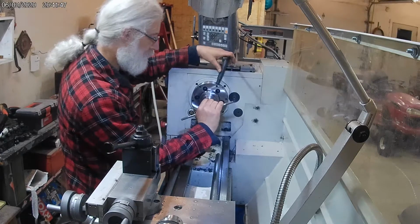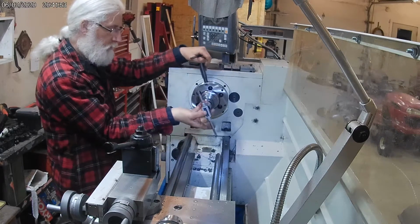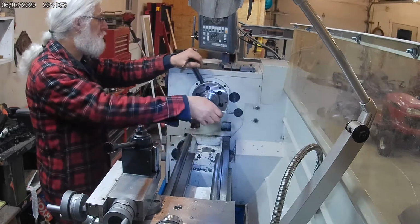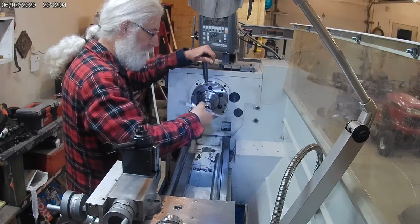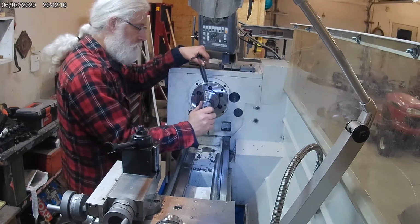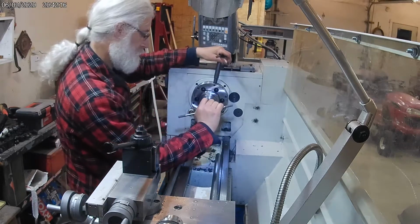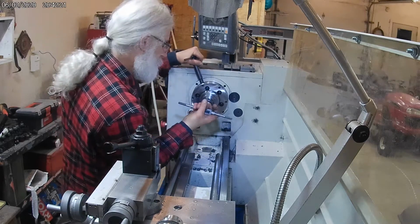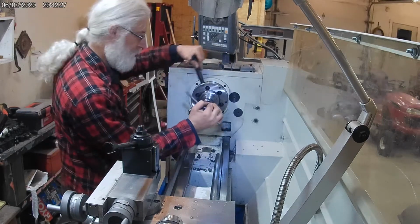I may need to get a bottoming tap because I think what's happening is this is a standard one, so it's about 5 threads that taper down, and it's not allowing the screw to go all the way to the bottom because of the taper. Because I should be almost at the reach right now, and the screw is going quite a bit shorter of what it should be. Let's see if I can get it close enough. Either that or I change the design of the cap and I don't do an inset.